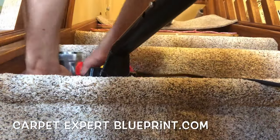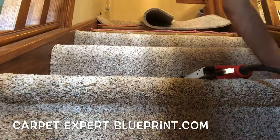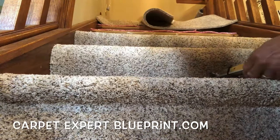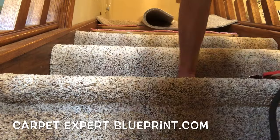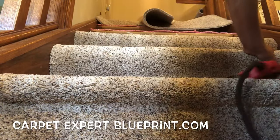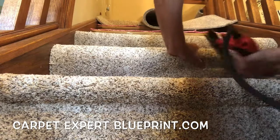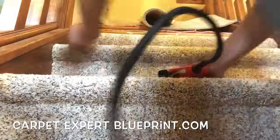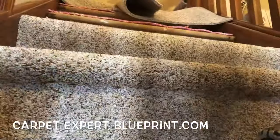So let's go ahead and finish stretching this up, shooting it down. When you start in the middle, you shoot it up, get it nice and tight, and then fan off to the left or the right — just pick a side, shoot that up, then shoot the opposite side, and then move on to the nosing of the stair. We're not doing anything violent here — we just got to attack the carpet aggressively with staples to make sure it's all nice and secure.